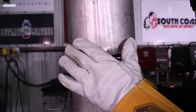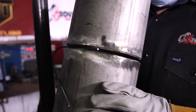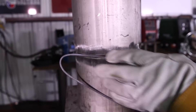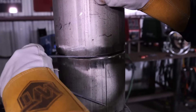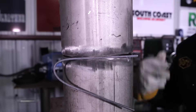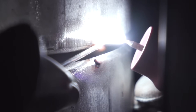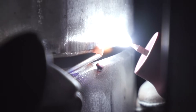If you're taking this for a test you want to make sure that it's perfect. Let's put this 5/32 wire back in there, close it up a little bit, and I'm going to tack the sides — that'll give me a true gap right there. So I light up, I drop a little ball there, light up, drop a little ball.